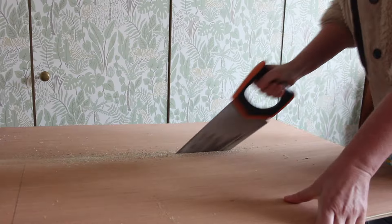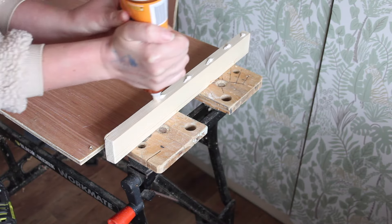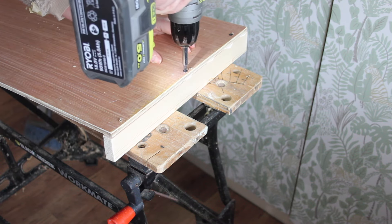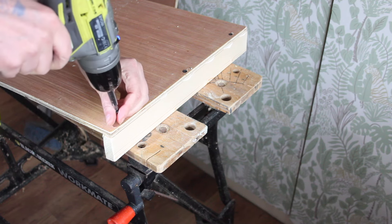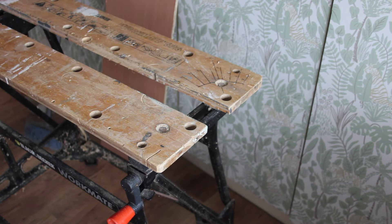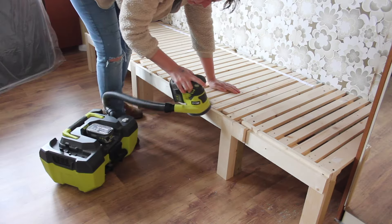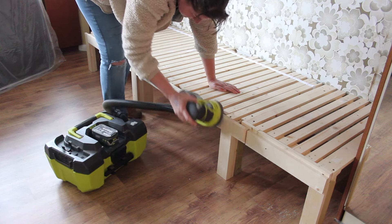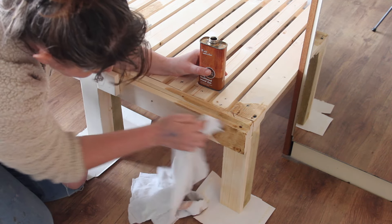As my alcove is longer than the length of a single mattress, I have about 40 centimeters spare once the mattress is in place — perfect for a little table. A piece of plywood glued and screwed onto a piece of timber creates a cute little table that just sits over the slats; the timber piece keeps it from moving too much. I give the whole frame one last sand and then it's ready for some color — I chose a wood stain that's almost the same color as the cabinets around it.